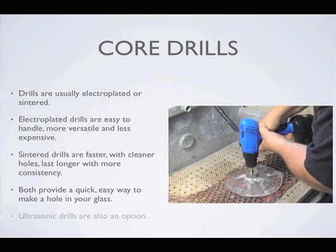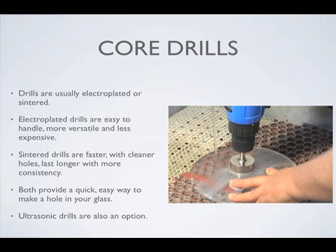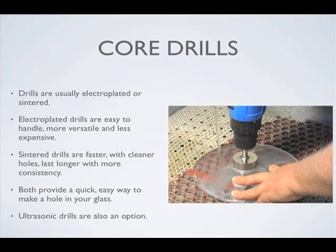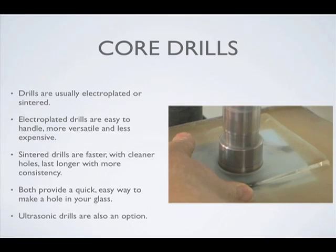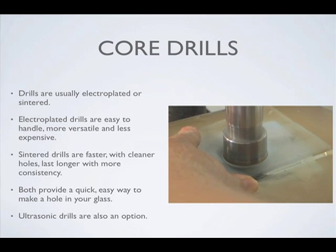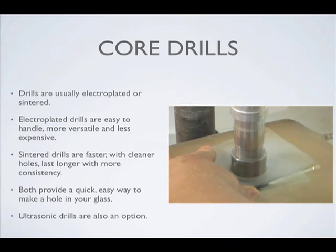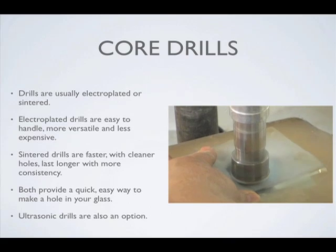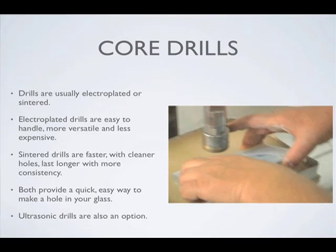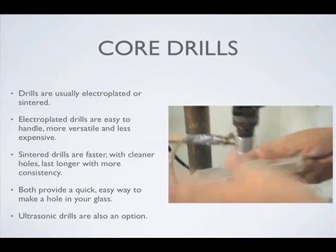Core drilling is a circular grinder. Depending on how you're drilling, what you're drilling through, and what your priority is, you may be after the core or you may be after the hole. The core can get stuck in there, and that almost always happens. Core drills are generally hollow so you can get a nail in it and knock the core out. If you're using a center drill bit, chances are you're just going to knock all the diamonds off the drill, so that's not the best way. I like compressed air — put it in the back and out shoots your glass. Aim carefully.